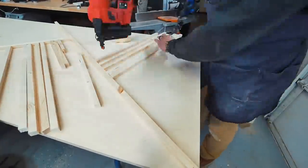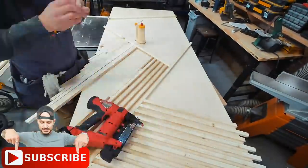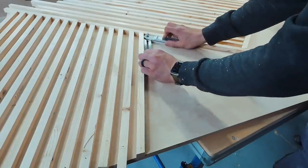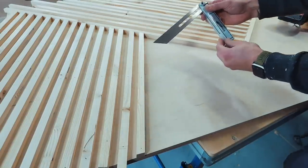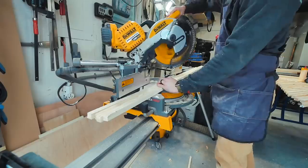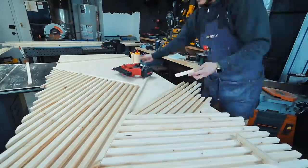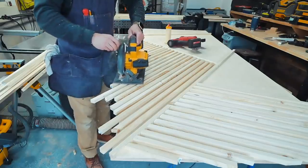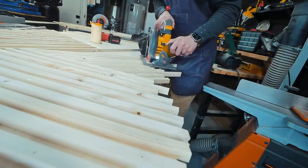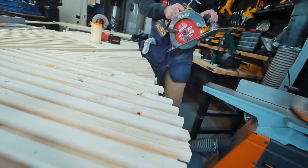The rest of the design was all angles and repetition. You don't need a protractor — just a simple T-bevel miter measuring tool, about 12 bucks or so. It lets you match the required angle to your miter saw to make the cut. The project was basically three different angles, so nothing too crazy — just repetition. The best strategy is to use a scrap piece of 1x1 as a spacer block between each piece to keep everything symmetrical, then have the pieces overhang off the plywood. Once secured, roughly trim them with a circular saw so they're not in the way.